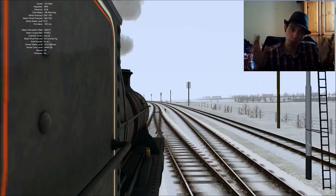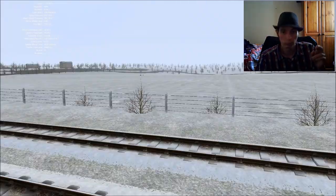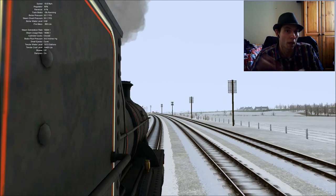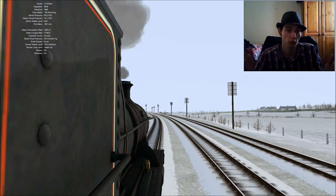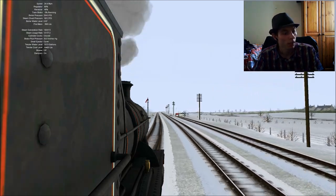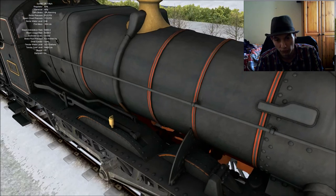Now, once there is a break in the brake lines, there's no more vacuum being supplied to the rolling stock. There's no more vacuum being supplied there to keep the brakes off. So of course the brakes then apply, thus bringing the stock that's broken away to a controlled halt. At least I presume controlled, I'm not sure. But that's the theory behind it. And it's actually a fairly decent safety device.